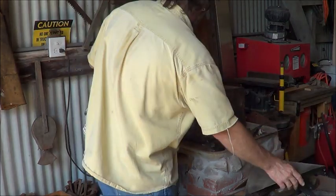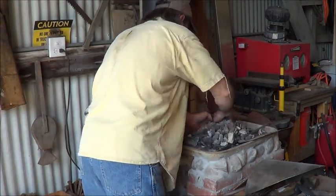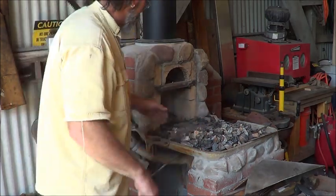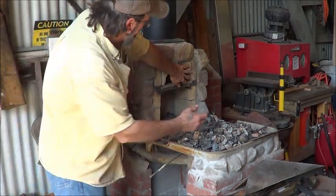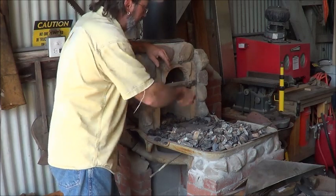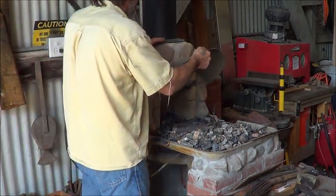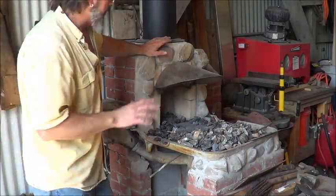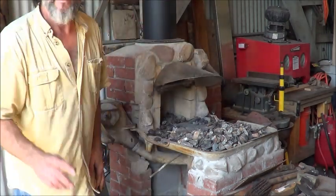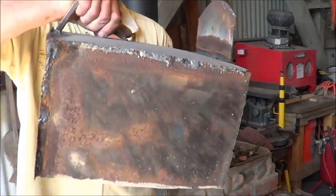This comes right off, and then this is what I call the spark box. The basic layout of the forge is pretty much what you'd expect. I took the cast iron, lined immediately around the air intake with fire brick and refractory cement, fire brick around the outside. Originally this was only this tall and I was getting good draft when I had a hot fire, but with all the turbulent air flowing around the shop, I was getting smoke out in this area. So I punched in a longer intake area for draft and put this hood on to catch that. Works very, very well. I take this thing off if I need to work on odd-shaped stuff. Stainless steel hood works great and looks good too.